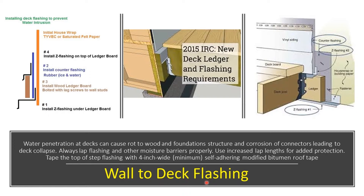Why is wall-to-deck flashing important? In 2015, the International Residential Code required that deck flashing be installed. This is to prevent water damage to the wood, to the sills, to the foundation, and to the structure. It prevents corrosion at the connections where the fasteners are secured to the wood — joist hangers included. We want to prevent deck collapse anytime moisture intrusion enters these areas.